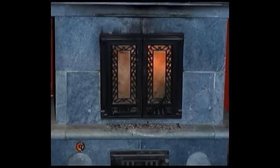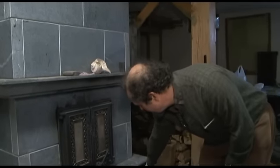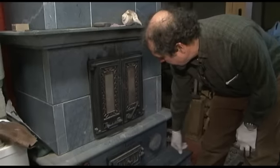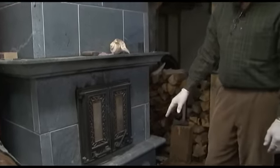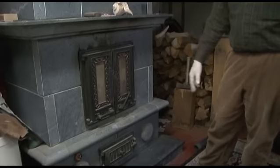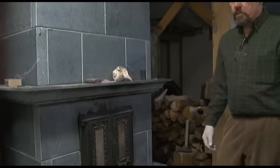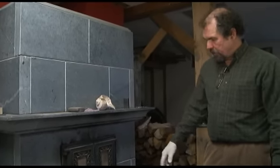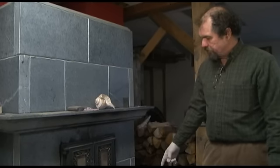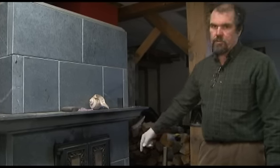To show you with this heater is that there's a little bit of maintenance required and a good way to do that. You see at the bottom here there's two plugs which come out. This heater is different from the one upstairs in that it has an ash door. There's no receptacle down below except that little chamber inside that door that we open every couple weeks to take the ashes from the fire out. What I want to do today is just take out the soot doors and that will give us access to the bottom of the heat exchange channels and where fly ash is going to be accumulating.